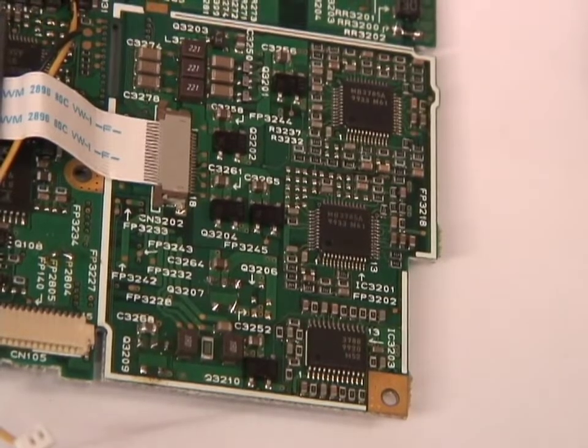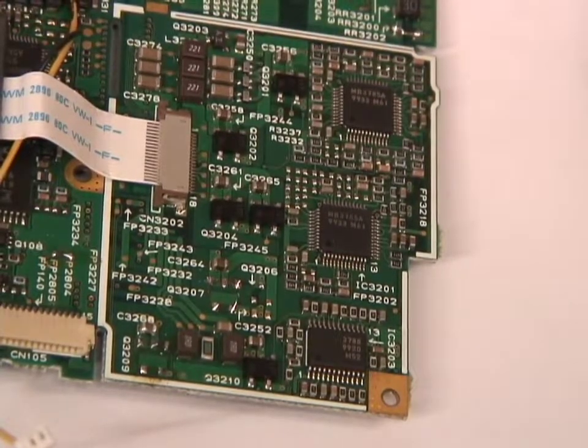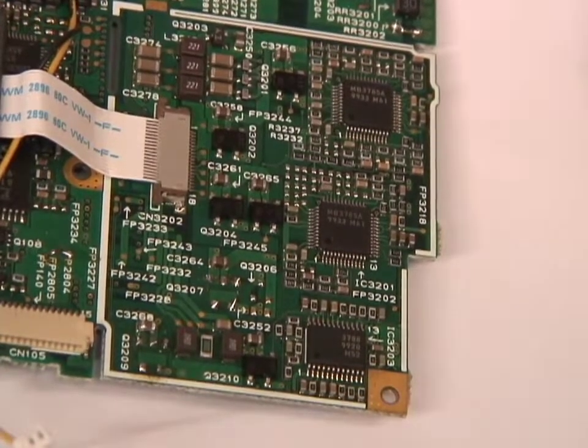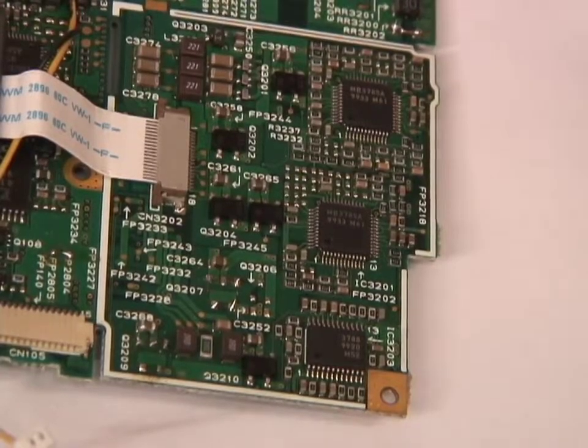Most of them were correct, but one of them is a 3V power supply which powers most of the main chips. That was actually measuring about 7.5V — directly from the battery. So that means that somewhere the 3V regulator had somehow failed. I had to use the schematics in the service manual to try and find how to get to the 3V rail.